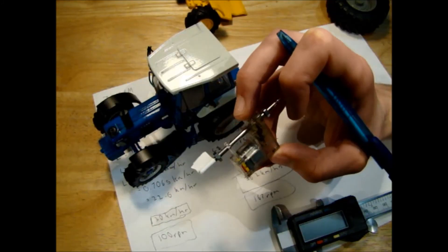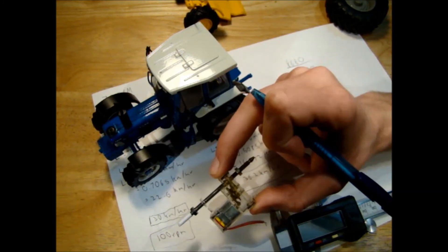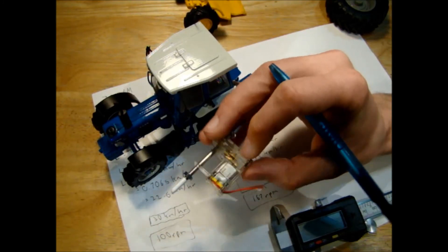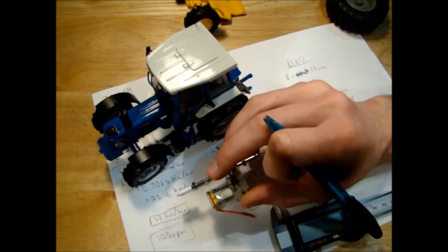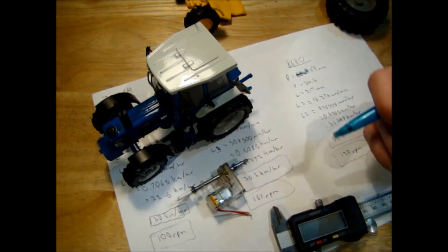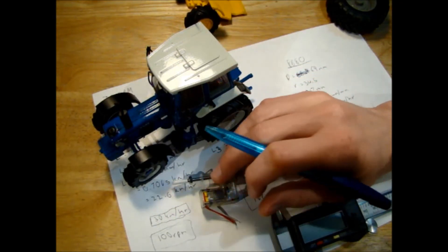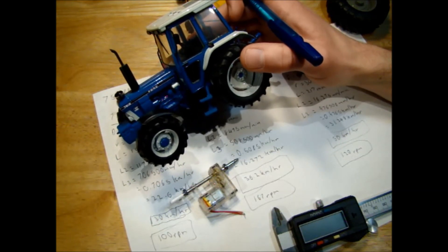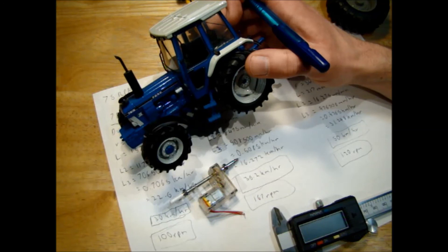If you had a 75 RPM motor and wanted to reach 200 RPM, you could just increase the voltage with a bigger battery. I wouldn't push the Siku motor over 3.6 volts, but the N20 motors are rated up to 12 volts — I personally wouldn't push them over 5 volts. If you found this video useful, give it a thumbs up, check out the calculator on the website via the link in the description, and head to the forum if you have any questions.